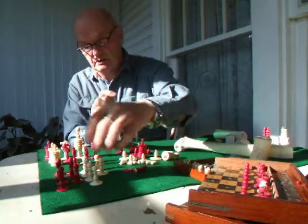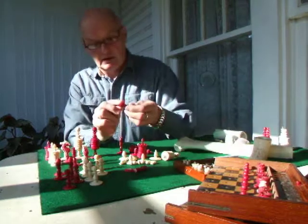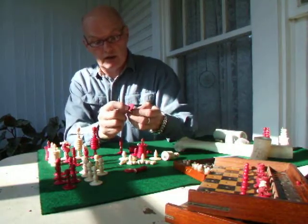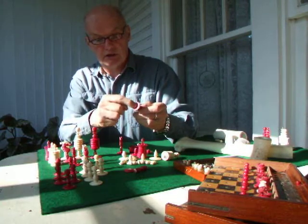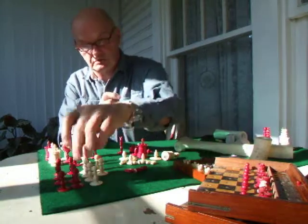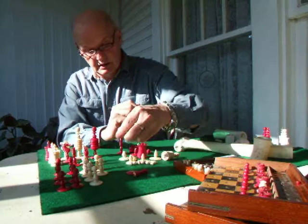And what's occurred there is that at some points the bases have come unscrewed and someone's attempted to put them back together. And they've got them wrong and ended up with one that won't go. And quite often you can see where the thread of the stem comes through the base a little bit. The old machinists always finished them off nicely so that you can tell where the bases have been put on wrong. But once it's been done, that's just going to have to be attended to and fixed with a new thread so it works properly.